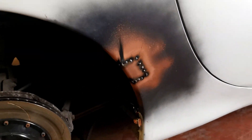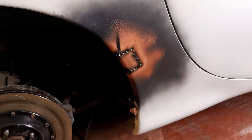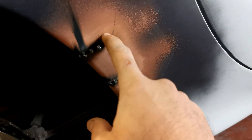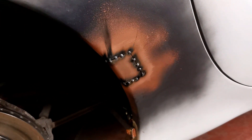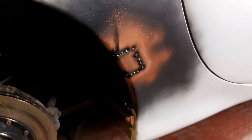That's now welded in — not all the way through yet because I don't want to put too much heat into it. First time really using the Artec in anger; I've only ever used it for practice. It's pretty decent — first time doing sheet metal work in a fair few years and I didn't blow massive holes in it, which is a win. I'll let it cool down, then join the spot welds up until it's consistent, grind it back, and then put some glazing putty or body filler over the top and we can move on to getting this thing painted.